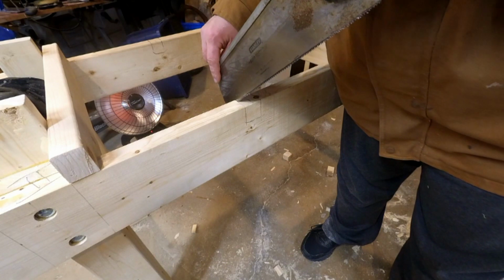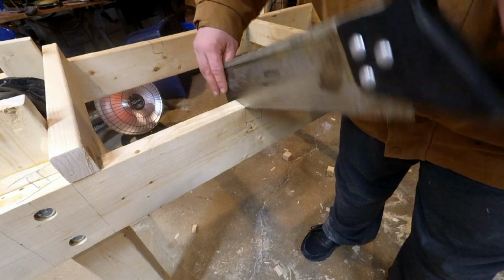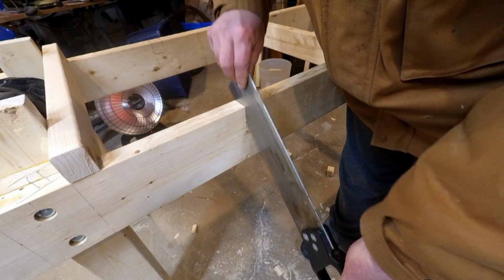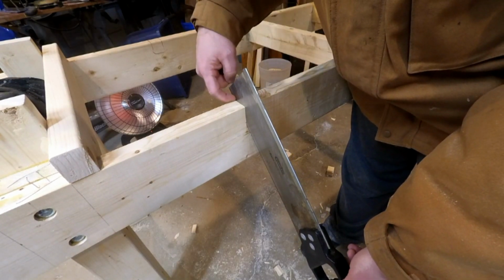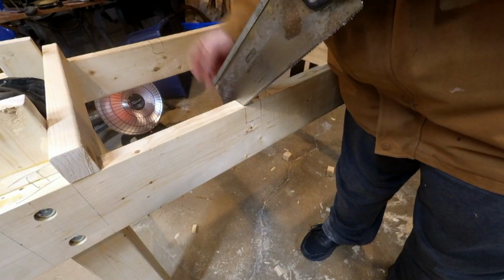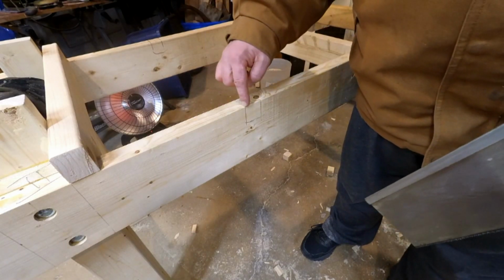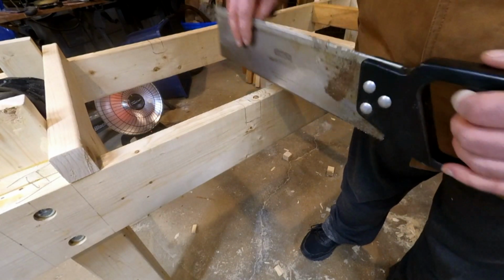Try to saw in a triangle so that you're sighting down this side. I'll do this here. So you're sighting down this line here and that line at the same time. So you're sawing, sawing, sawing. You get kind of about this way. And then you have a reference point here and the line, and a guide here. And then as you're sawing down the other side, you can saw that line with a guide on this end of your blade. So that's all sawn out there.